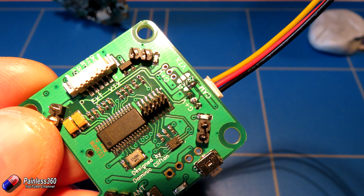We're actually going to use a little FatShark camera on here so we're just going to select 5 volts. On the other side you can see the soldering pads for the voltage selection for the video transmitter, but that's only if your video transmitter dies or has a problem and you want to use a third party video transmitter. We're not doing any of that so we don't have to do any soldering there at all. We don't even have to solder in the connection for the external video transmitter — all we need to do is just this one little bit of solder for the voltage for the camera and we're done.